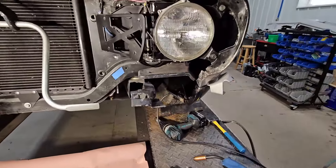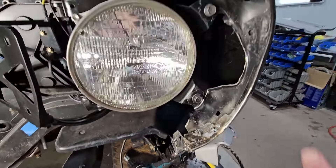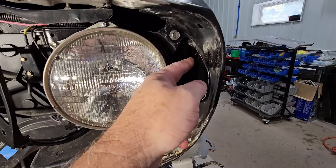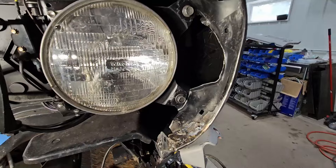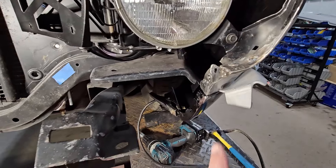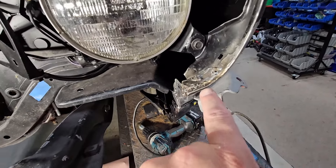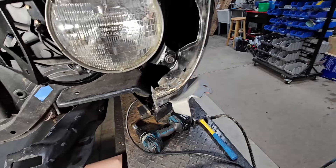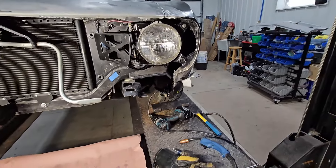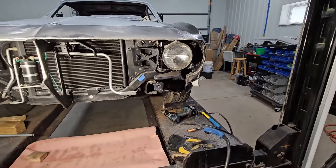Alright, we've started our stitching — just did a couple spots down in here and was actually hammering this a bit nicer. I'm going to grind that very sharp-looking thing in a bit. You can see this whole thing needs relieved. I've got some fill work to do here and here and a little bit right there. This is an area I don't want to warp, so it's literally one tack, go somewhere else, one tack, wait. So this will take a few minutes.